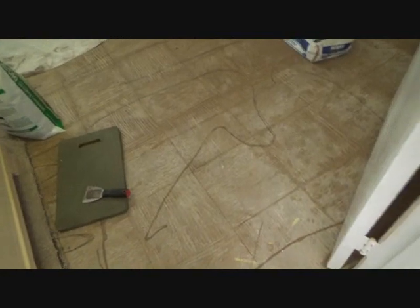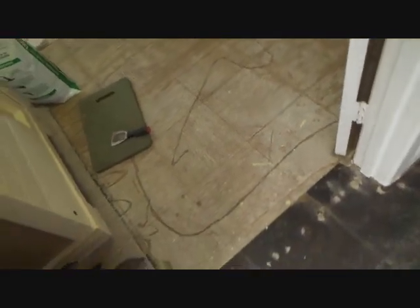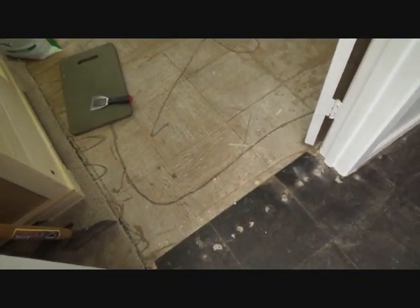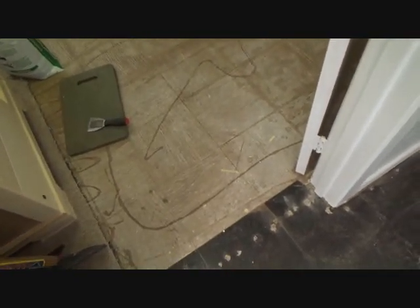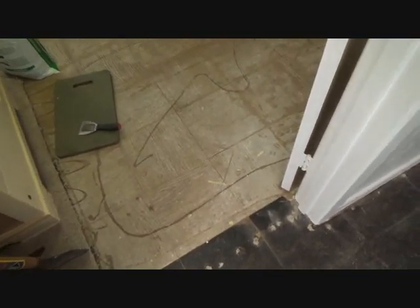Okay, but usually my experience has been that vinyl asbestos tiles are a little bit smaller tiles. These are 12 by 12. They're a little bit thicker than these. These are very thin, and usually they're stuck down to where if you start scraping a floor and they come up in small little chunks, and you smell it, it has a definite defining smell. You will probably know it, whether or not you have asbestos tiles. Now these tiles don't have any smell at all.